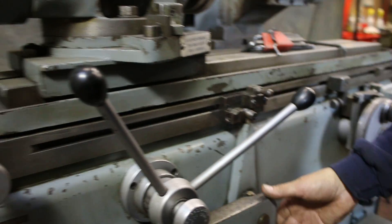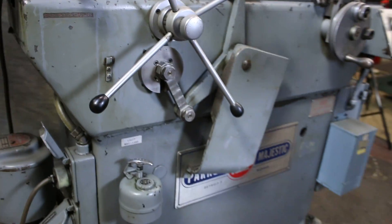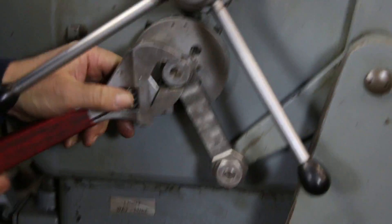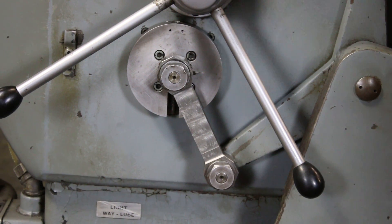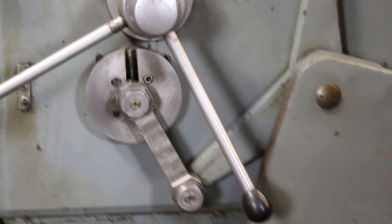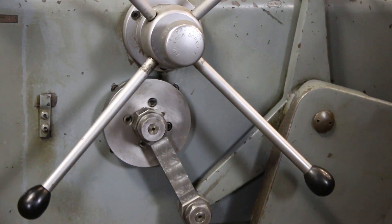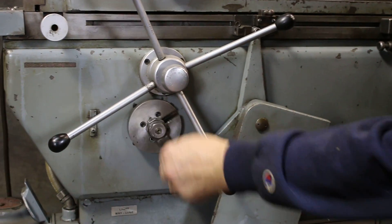Stop the table, open up this cover, and this could be put into what's known as a reciprocating mode. To loosen this nut here — you'll see now that in the mode that it's in, the way that it's set up right now, when our table is traversing in this fashion, that this arm is rotating around its axis. Otherwise there's no eccentric here.